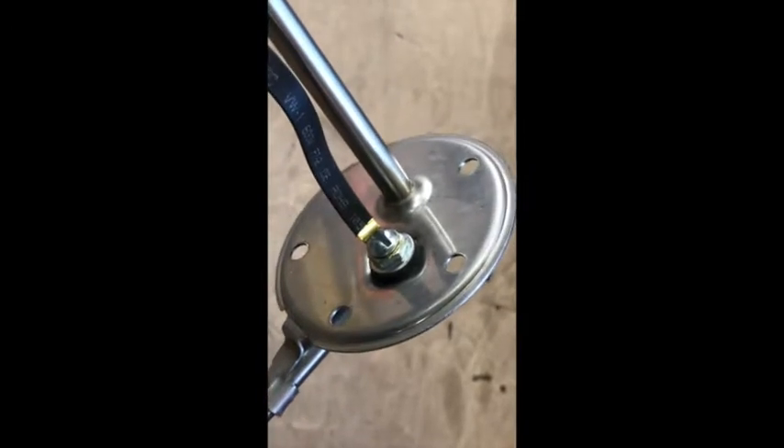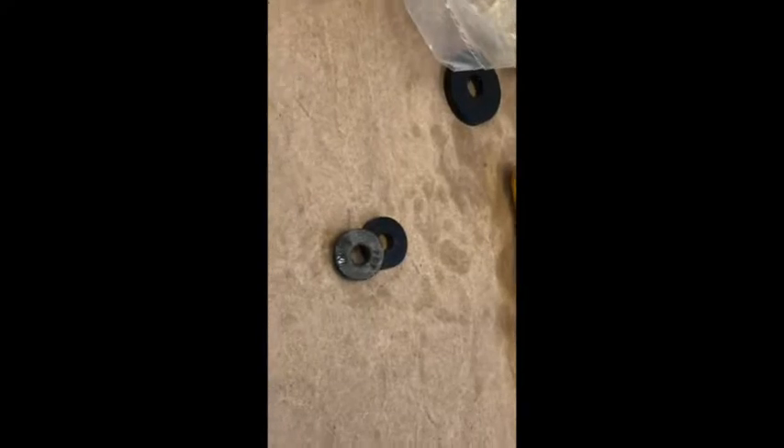I had to enlarge the hole a little bit in that brass strap. I didn't have a brass screw — I looked for one and I couldn't find one. Enlarged the hole in the brass strap so the 10-32 would go through it. Put a nut on it. So I fastened the screw to the strap. Went through my assortment of plumbing washers — you know the faucet washers? I found a pair of those that were one size smaller. Pretty small, probably a quarter inch.